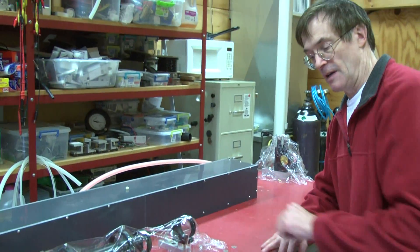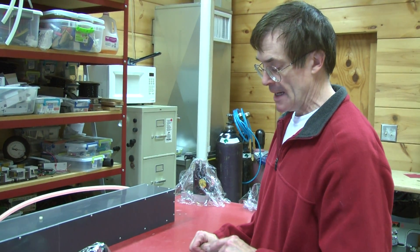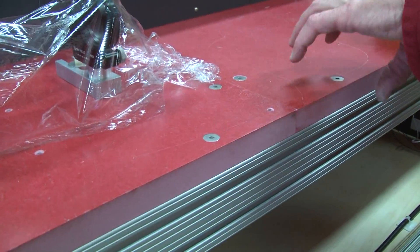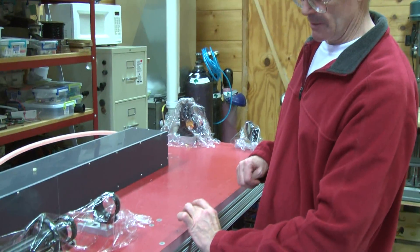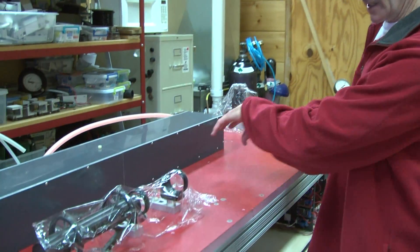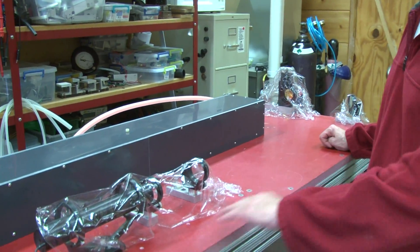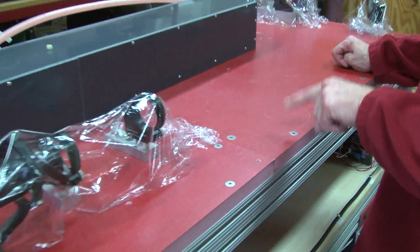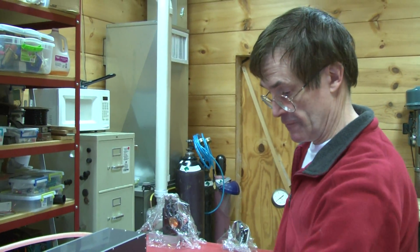The 8020 material is also extremely stiff and when coupled with this fiberglass platform up here, very very rigid. I can lean on this while modifying optics and you don't see any position shift or distortion of the alignment. The fiberglass is an electrical grade fiberglass plate purchased from a U.S. distributor called McMaster Carr. It's 25 millimeters thick, extraordinarily well made, dead flat and square no matter which side you put a straight edge on, providing a very nice working surface. When I needed to enlarge the laser I just duplicated the two pads and now I have twice the structure.